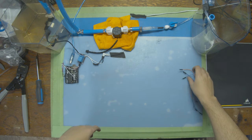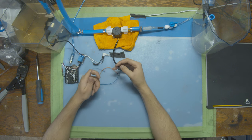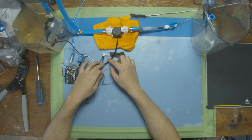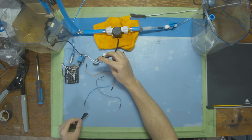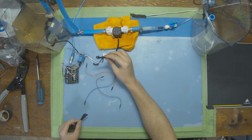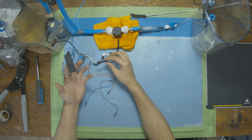Now that we're done with the tubing we need to get our cables connected. The nice thing about the flow sensor is it's pretty simple — it only has three cables: red, black, and yellow. The red and black are power and ground, and the yellow is the signal wire. My sensor comes with a connector so I'm going to use DuPont cables and insert them in, then tape over them to make sure they don't fall out.